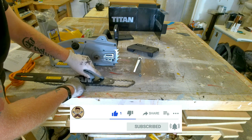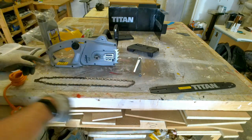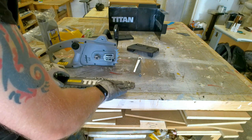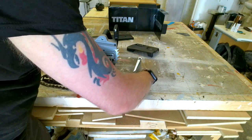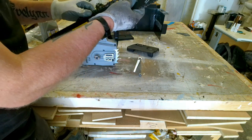So you get your upwards bar there and then your backwards cutting tooth that way. The blade rotates in an anti-clockwise direction. Next you slide it onto the groove of the guide bar — I'm just going to use my table as a little helping guide. Slide this all the way around as you can.